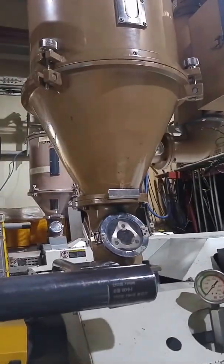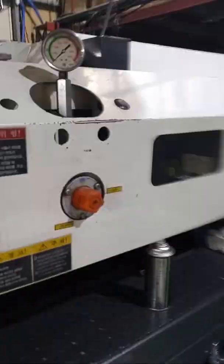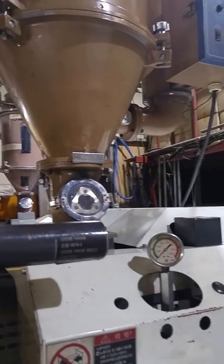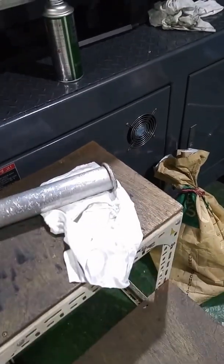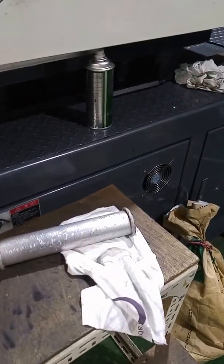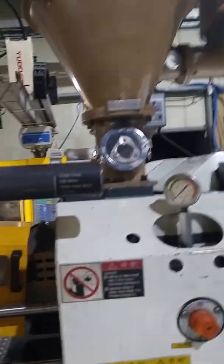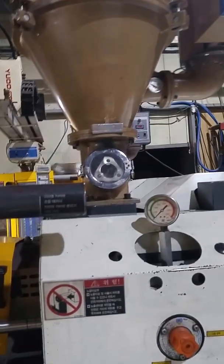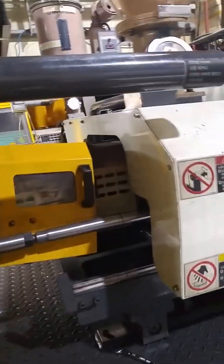The hopper itself is already clean. To clean it you have to do it several times — you have to vacuum it, then air it out, then wipe it off. After you wipe it off, I had to use a towel, put a little bit of kerosene, and wipe the inside and out, making sure there's nothing in there. So that when we put the next batch of resin, you wouldn't get defective products because of the different colors.